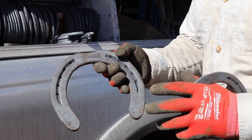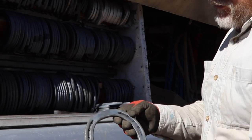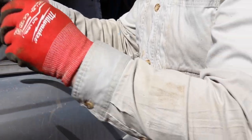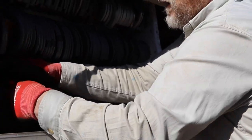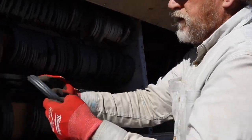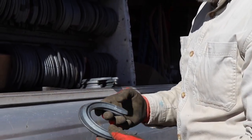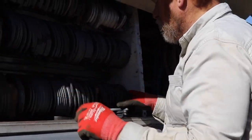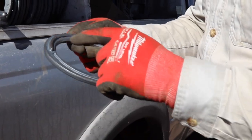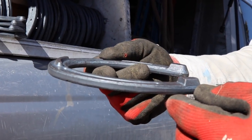This is a six, so this is about an average-size draft horse. Then you've got these narrower shoes that are not as big and wide — a lot of these are for half draft. That's a size five, and you've got a size three, and then a two. These are an eventer shoe, a little wider web but has the rim on them. Then here's a number four — this is what they call a toe and heel, which has a little bit of a caulk for traction.